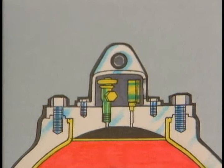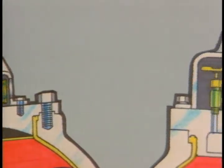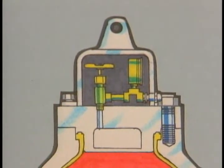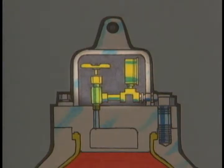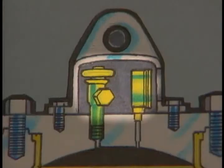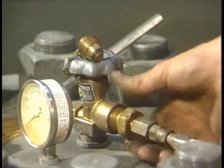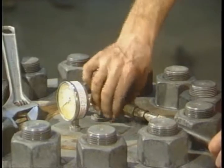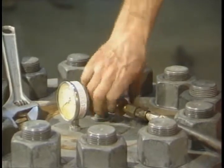The cover plates, or heads, are nearly identical, each with a charging valve, pressure gauge, and valve guard. On the Continental unit, the gauge and valve are mounted in a single unit, while Hydral has them mounted separately. The charging valve is where you'll bleed the pressure off, as well as administer the nitrogen precharge. Since the two units are different, have the servicing manual handy.